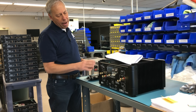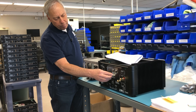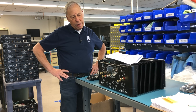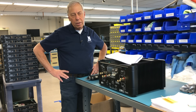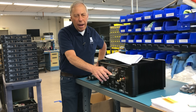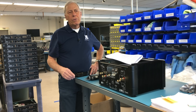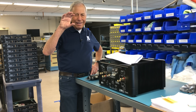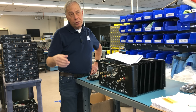We could do the same trick that David did using a couple of Zeners. This amp clips at around a volt and a half, two volts, something like that. So you could put something that, as it approaches clipping, will start clamping that voltage. And that's what you could do.